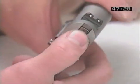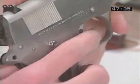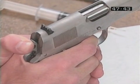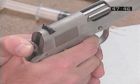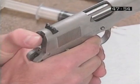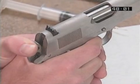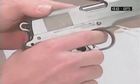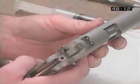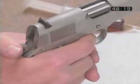You also want to check, while you've got it, to see if the screw in your trigger is adjusted in too far. This will affect the over travel of it. If it's in too far, right where your half cock notch and your sear cross paths, you'll feel it bumping. You should have complete freedom with your hammer going all the way down and all the way back. You shouldn't be able to feel anything. But if you feel it right in there, it's usually your sear bumping it, and you need to adjust your trigger screw back out because you've got it in there too far. This one has plenty of clearance on it now.